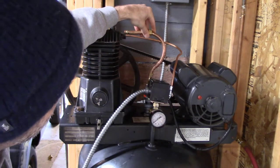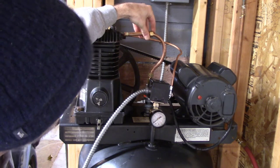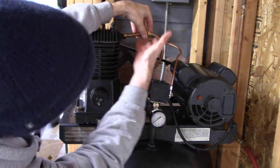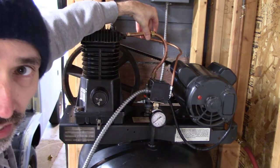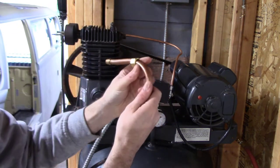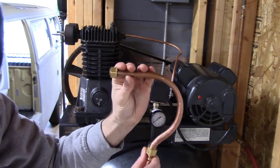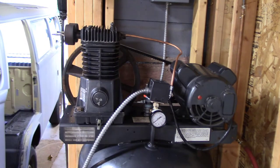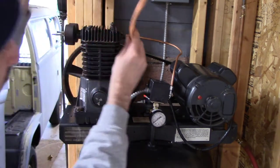The other problem is even when I have this right, because of the proximity here going from horizontal to vertical, you often have to bend one piece out to get the other in, then end up having to loosen the top or bottom fitting. You end up with lots of problems when dealing with compression nuts on different planes. So my new idea to avoid that is to make it more like a question mark shape.